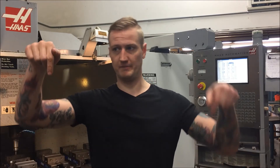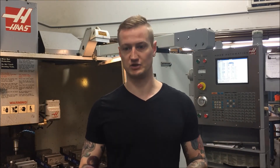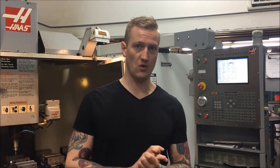There you have it — a quick and easy way to set a zero using an edge finder inside a vertical mill. You can pick up one side of something, raise it up, pick up the other side, divide by two — bingo, you're right in the middle. You can pick up the edges of things; there's a lot of different ways to set your zeros. This is how to do it with an edge finder and how to put it in your offset screen. If you have any questions, email me or leave them in the comments below. Make sure you like and subscribe. Thanks for hanging out!